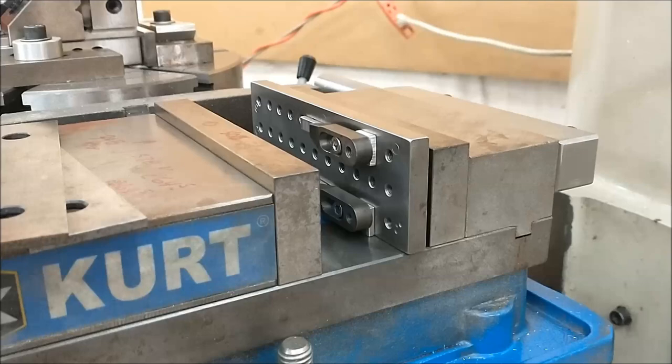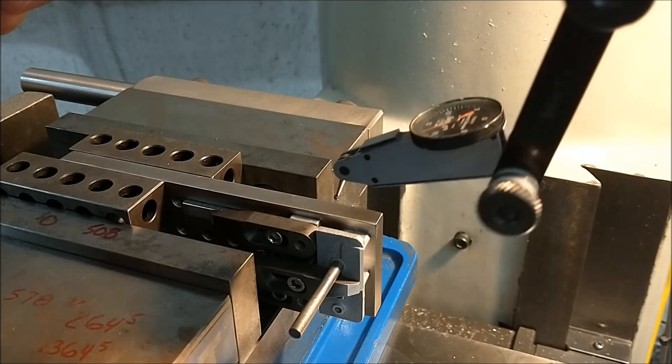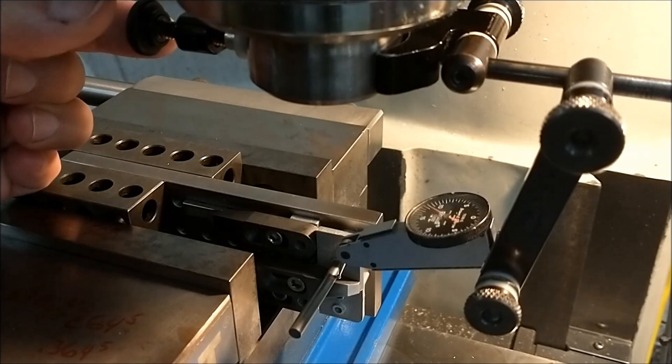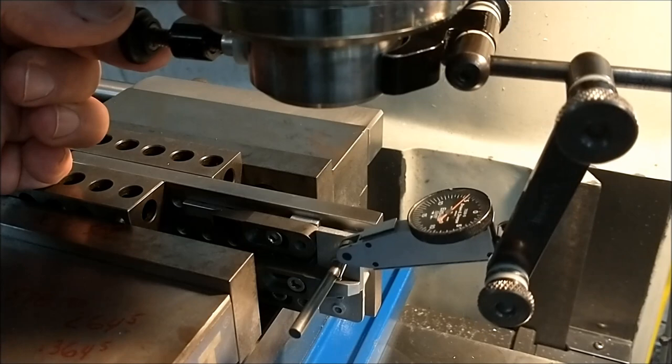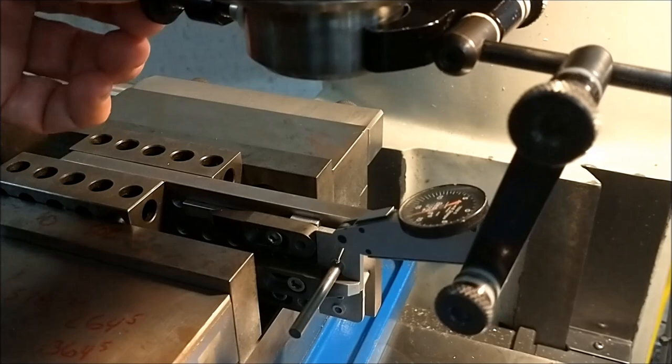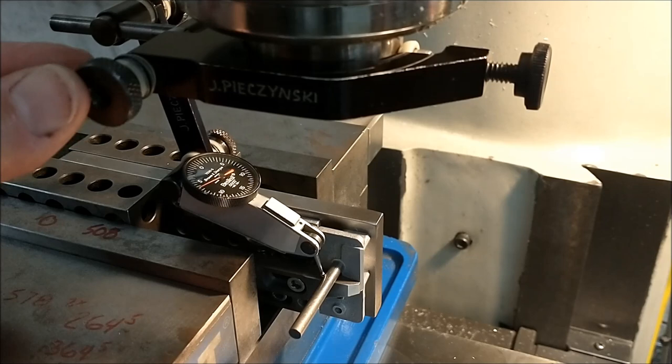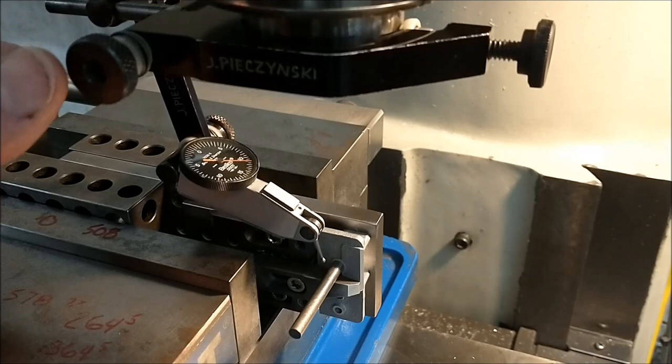With the part securely clamped and the fixture plate positioned vertically, install a pin to pick up the center line of the hole that the dimensions are referenced from. Sweep the pin accordingly. Find the high spot, find the low spot. Looking at six before. Look around, do it again. Find the high spot, find the low spot. Six before. You can effectively call this your X0.